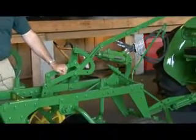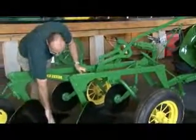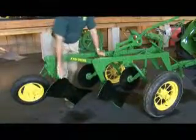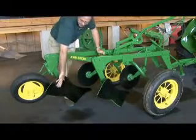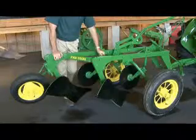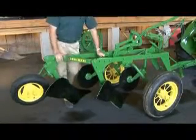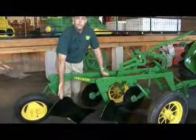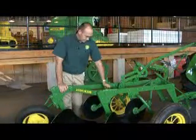The moldboards developed greatly in time. We went from a single-piece moldboard, like we saw on the walking plow, to a three-piece or two-piece. This happens to be a two-piece. You have the plowshare down here and the moldboard up here. Again, it was a convenience for the owner that as the cutting edge would wear out, that could be replaced without replacing the whole bottom. This didn't wear near as quickly as the actual point that contacted and cut the ground.